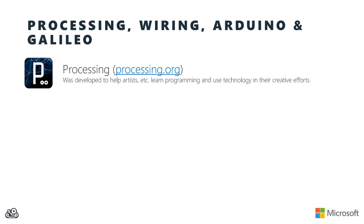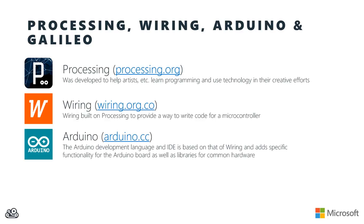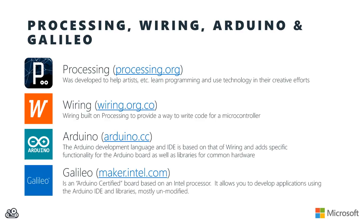Processing was based on Java. Then along came Wiring. Wiring used that same Processing IDE and programming model, but based it in C and C++, and used it as a way to write code for their microcontroller. When Arduino came about, they used that same Wiring IDE and C and C++ language to write the libraries for Arduino. And because Galileo is an Arduino certified board, we can use the same Arduino IDE and programming model to create code for our Galileos.